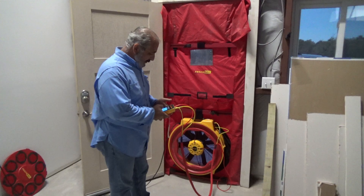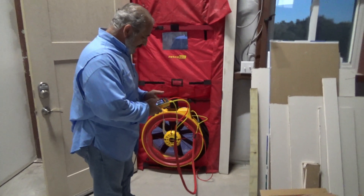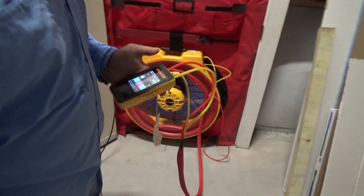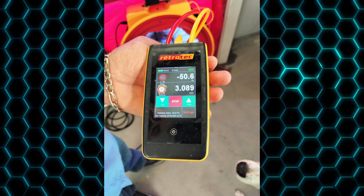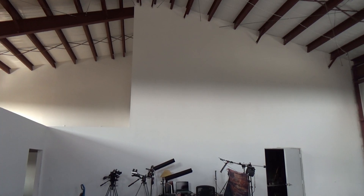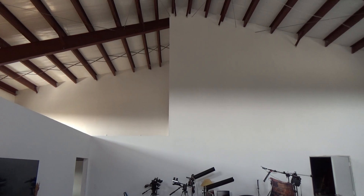One of the things that was really interesting — in order to get the Certificate of Occupancy, every new building now requires something called a blower door test. They basically put a fan in your front door, suck air out of the building, and measure how many times the air changes over in an hour. In my part of the country, you have to be under five. It scored around a three after I sealed up a bunch of leaks in what I term the Great Wall of China to my right. That wall took 3,000 square feet of drywall on both sides. We passed the blower door test and got the certificate.